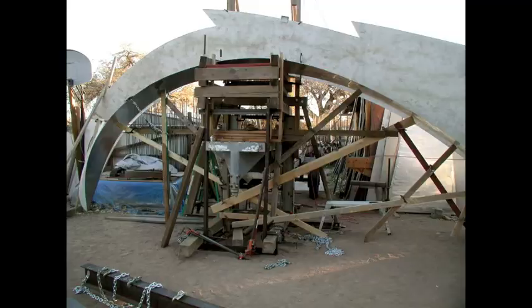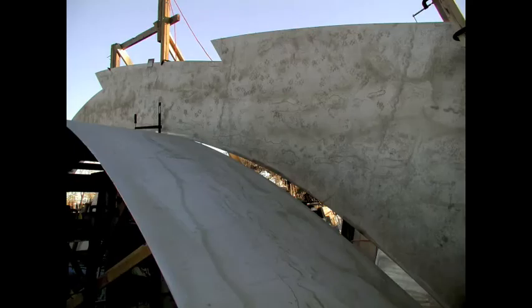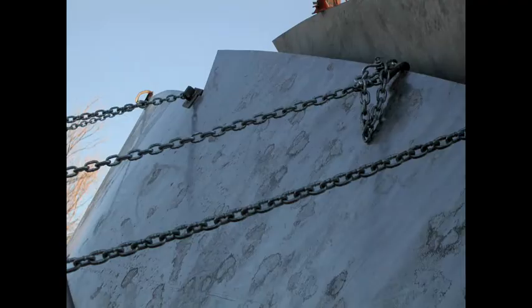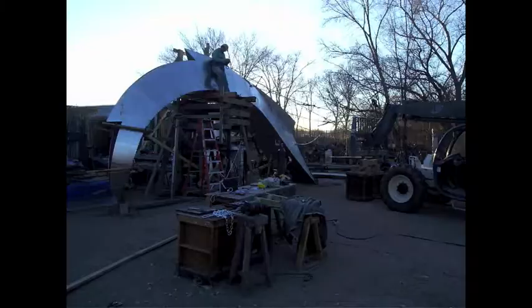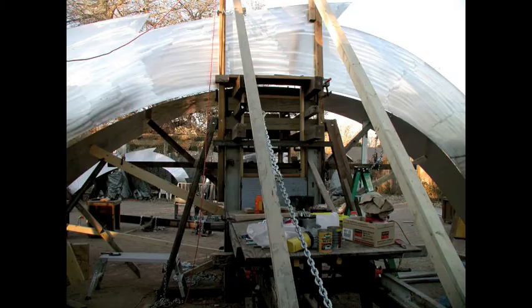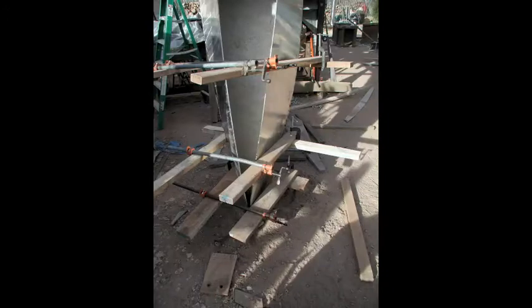And we pre-arched metal and we fabricated together. And then we ran into a problem because the weight of the metal was so much that the unsupported sheet of metal wouldn't stay where we wanted it, collapsing on itself. It was a problem. These multiple chains here actually show you where pick points where we would pull the metal back. And then once we overcame that, then everything started coming together.